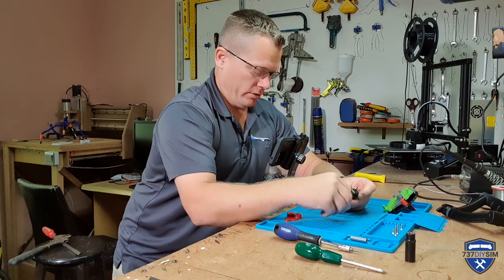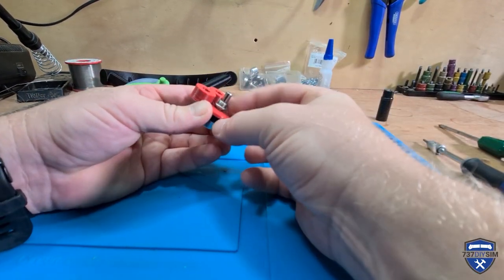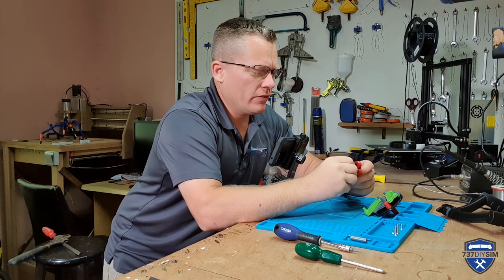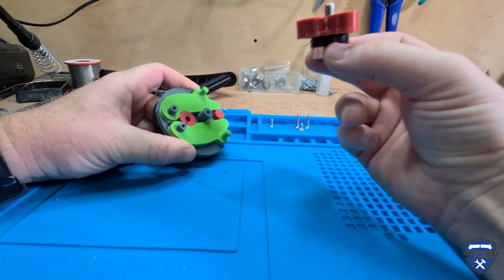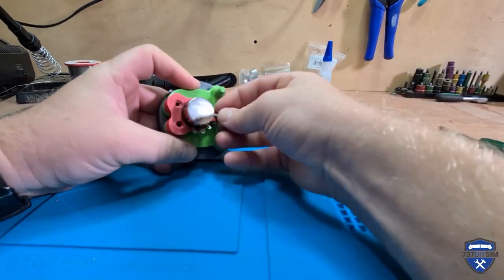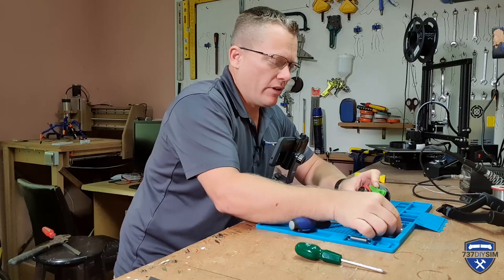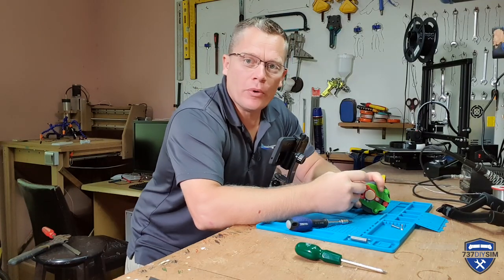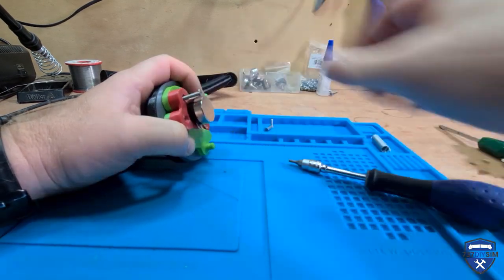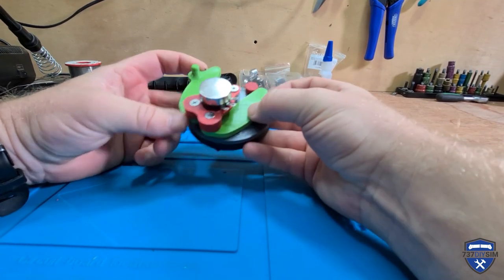I'm going to insert the pot into the pot cap, with the wires facing down. Now that we've got the pot and pot cap, let's try to center the pot shaft in the middle. The pot shaft is designed to be a tight fit into the center of the shaft and has to go over these three locating studs. We've got the shorter of the three screws going in the long stud, because there's not much stress on that stud. The two studs at the rear have the pivot points for the tongs, and we want to put them into the top plate all the way through so it's the stud taking the strain, not the plastic. Make sure there's no interference on the tongs.